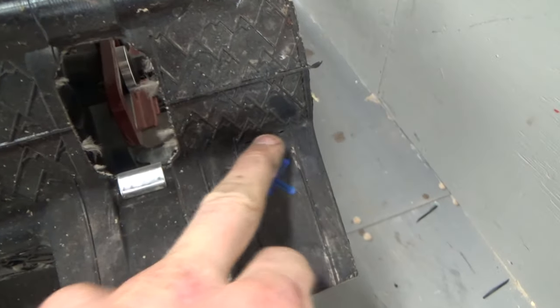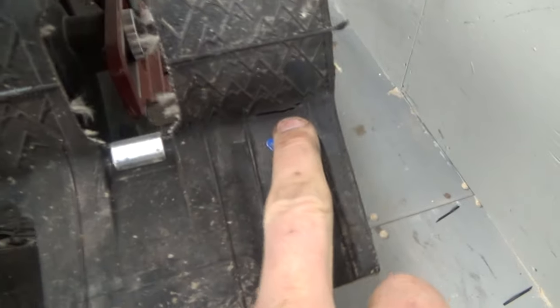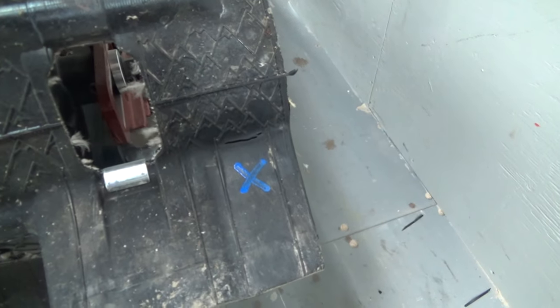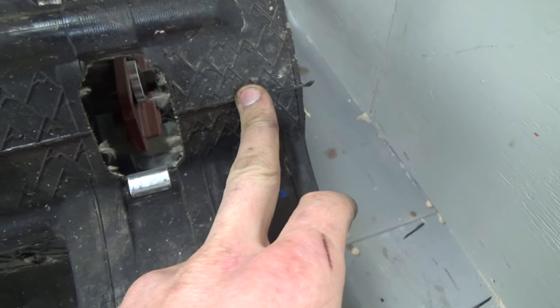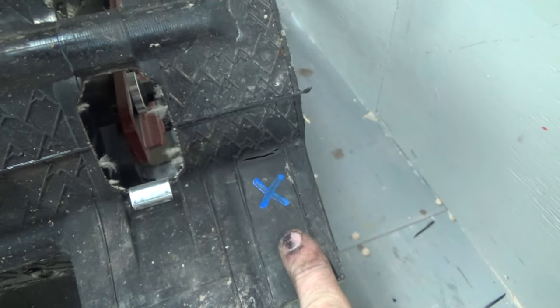This is the one I didn't like as much because it's right at the base and right on the edge, and that does a lot of flexing. There's nothing really to do stitching here — basically, if this starts to separate, you just have to cut this whole lug off. After my first ride I'm going to inspect this. If anything else propagates, this part of the lug is gone — I'm going to cut it right off. There's no real way to fix structure in a track, so I'll put a little cement in there and keep an eye on it.